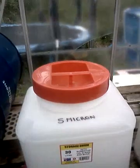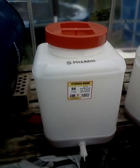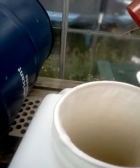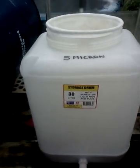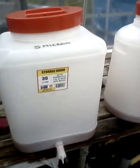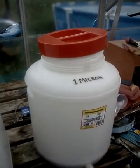Then I've got a 30-litre square storage drum. The larger filters — this is a 5-micron filter — fit perfectly in the top of those containers. It's just a matter of picking it up and putting it underneath with the wide aperture at the top. It collects all the grease and yuckies and comes out relatively clean.